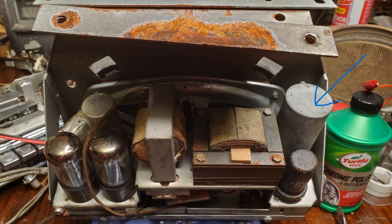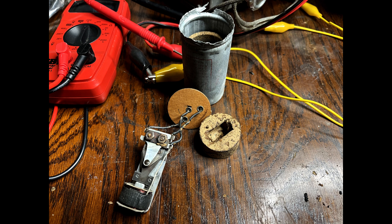The vibrator is very well clamped in place to reduce noise — since it's vibrating all the time, it should be held in place so it's not rattling around — and also to make sure it doesn't fall out. The vibrator is quite difficult to pull out, but it does simply pull straight out. You can wiggle it a bit, but there are no tricks. You will notice that the end of the vibrator is crimped, so you can take a screwdriver and some needle nose pliers to just peel up the crimps. Once you uncrimp it all the way around, you'll be able to pull the insides out.